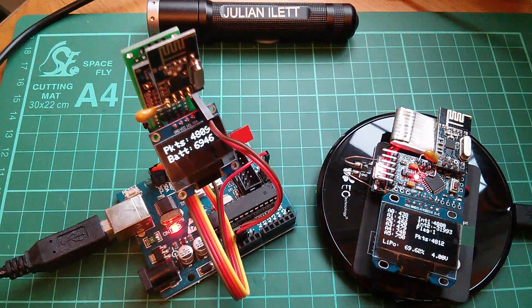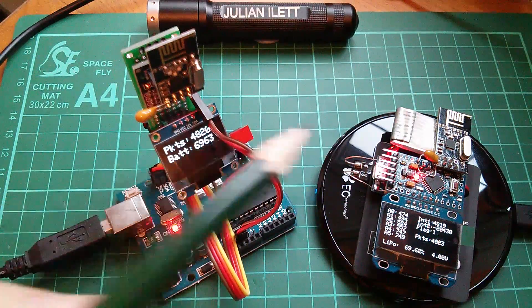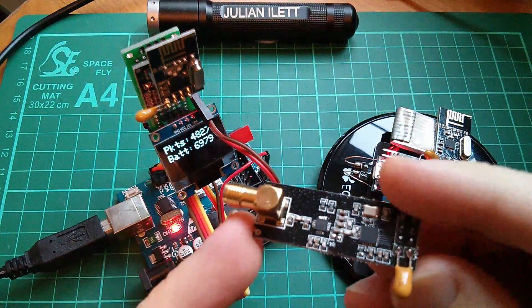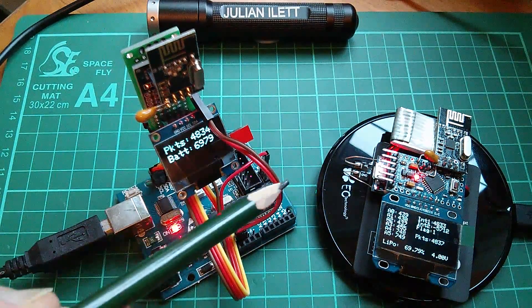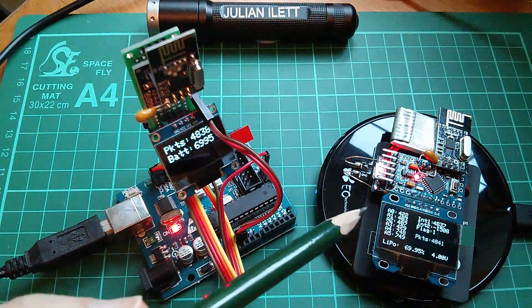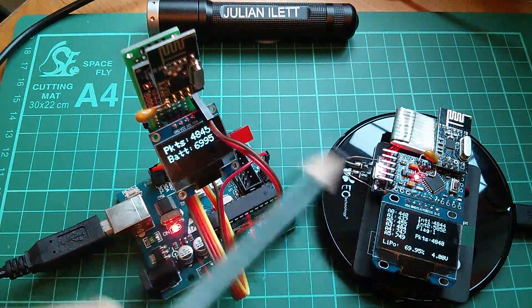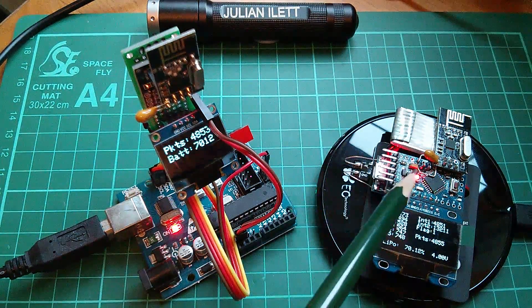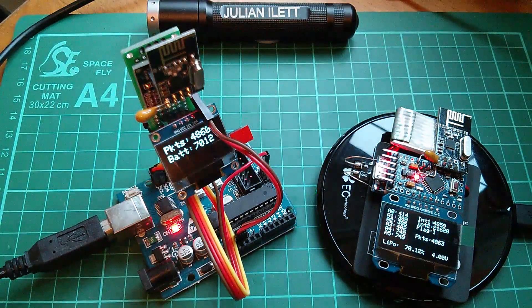There are going to be some radio control enthusiasts who look at this and think: how can you even contemplate using these cheap transceivers for radio controlled flying models? Well, I think this is going to be okay. Yes, it's cheap, and that's a primary concern. If range becomes a problem, I can look at higher power transceivers with a screw-on antenna. Also, you have data integrity here — if packets don't go over cleanly, the acknowledgement packet doesn't come back and the data packet is re-transmitted. So as long as it can all be done quickly enough, the data integrity is going to be excellent, and you've also got this telemetry path back from the receiver to the transmitter. I think there are compelling reasons for using these data transceivers as a radio control system.